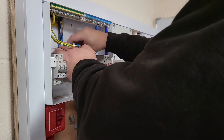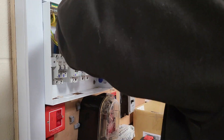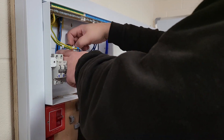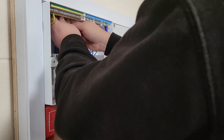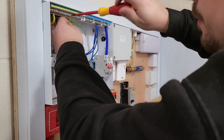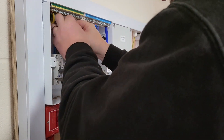I tend to spend about an hour on a consumer unit and can get a reasonable result in that time, but it's not all about the looks — these things are going to have a lid on and nobody's looking at it for five years. While you don't want a rat's nest, you don't have to leave a work of art either. Moderation is key. For the CPCs with top entry, I tend to swoop around in a horizontal plane behind the neutral and CPC terminal bar, then loop up into the CPC earth bar to leave some length on those cables.